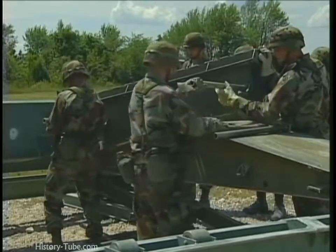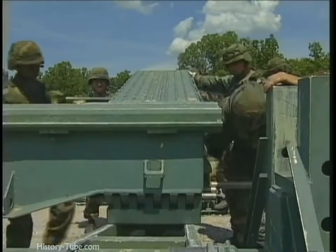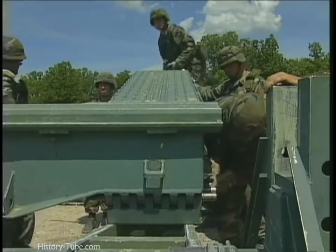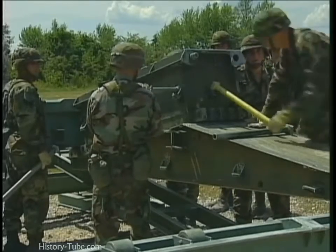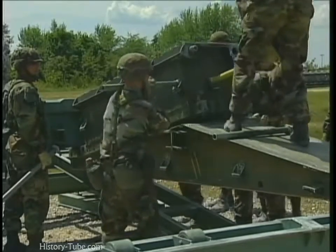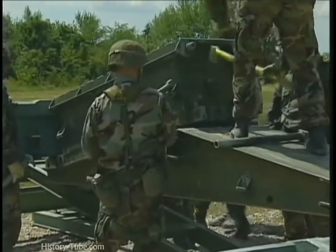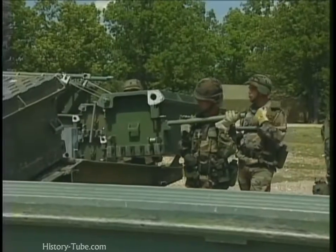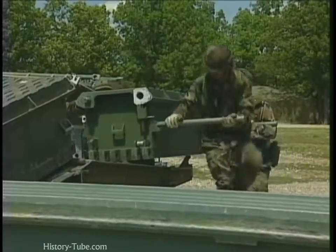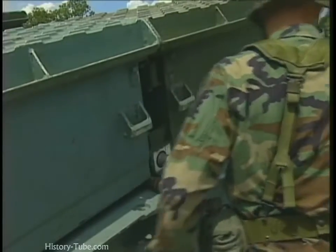Connect the top panels to the bank seat beam. Secure each with panel pins. Raise each top panel slightly to insert a panel pin between each panel and the end taper panel. This will help provide the best angle for connecting the junction panel. Connect a second panel to each of the first top panels using panel pins to secure their placement.